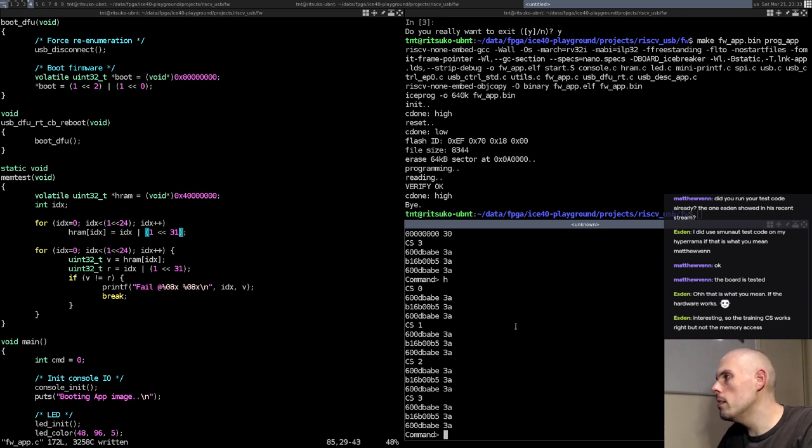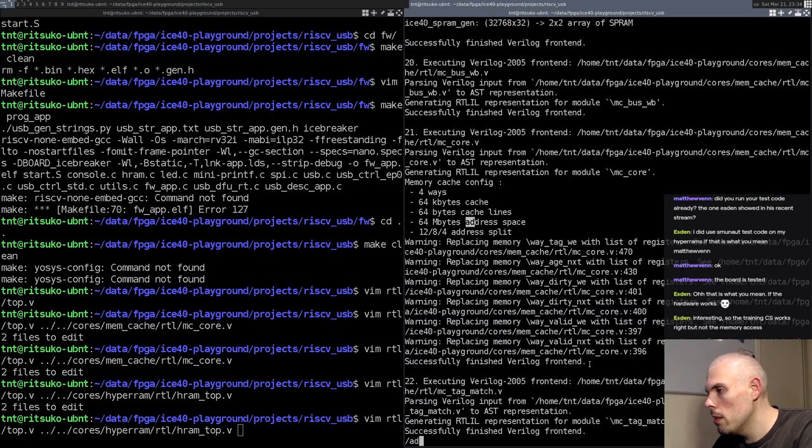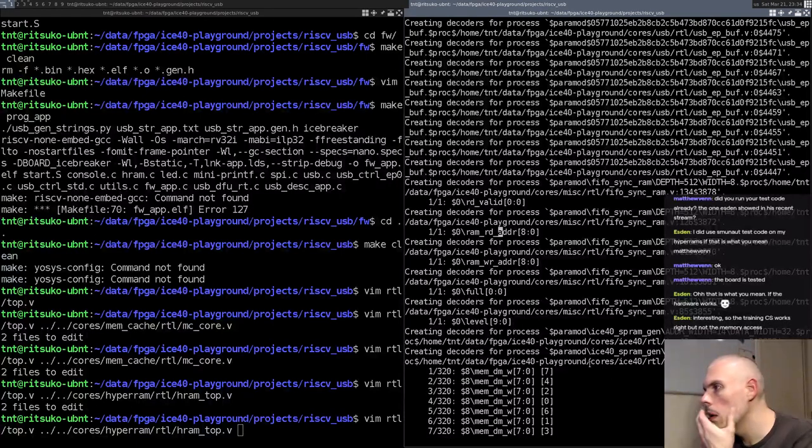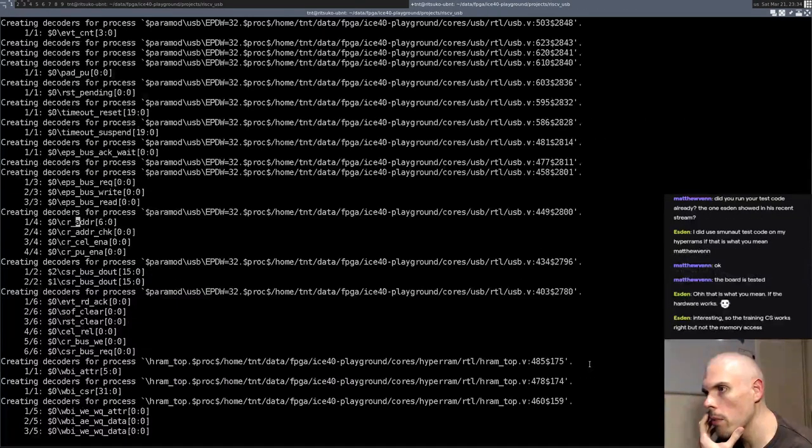Yeah, exactly. Why would that be? It's not accessing the first chip because else I would be reading the value, so it's just not accessing anything. And so that's why I wanted to check, see if there was a warning on an address line or something that would have the wrong width or something.